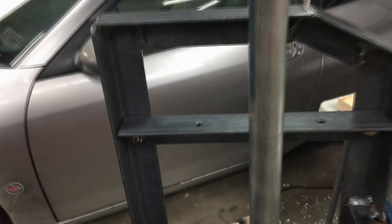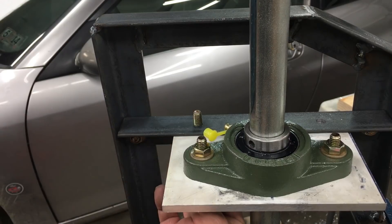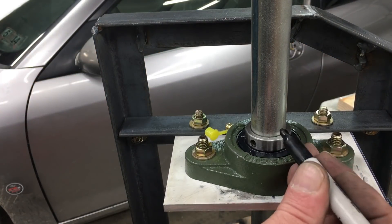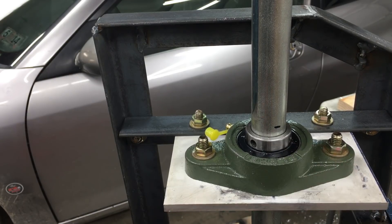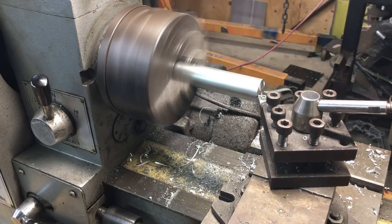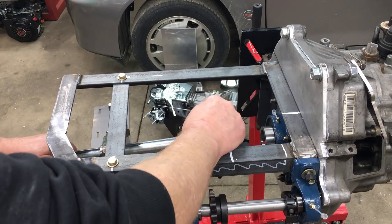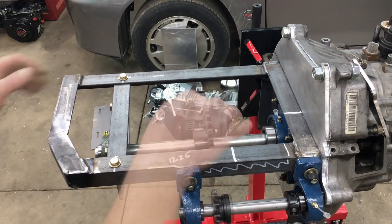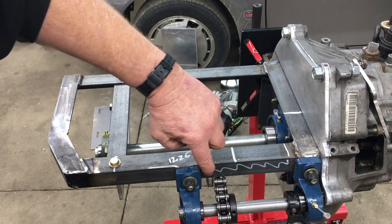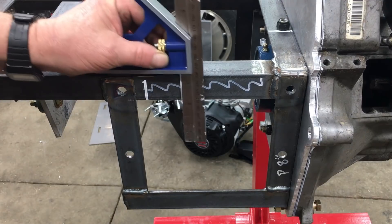So let's see how the bearing hanger fits. Not too bad. Now I use nylock nuts for everything, but during the setups I use conventional nuts. So it looks like we can cut the input shaft right about here. And now a quick visit to the lathe to clean up the rough cut. At this point we can start working out the details of the chain and sprocket system. Looks like we're going to need to do some more cutting. Now I'm cautious about cutting too much material from this area, so we'll do it in steps. I like to use high contrast paint pens to make my cut marks. Sharpies will also work, but sometimes they're hard to see.